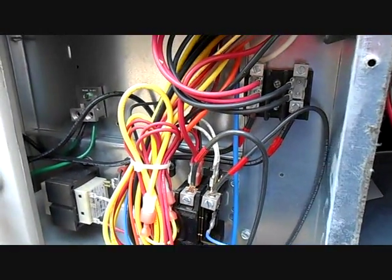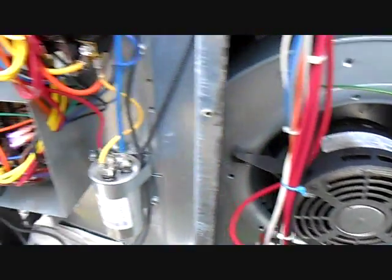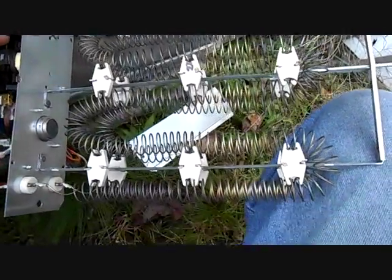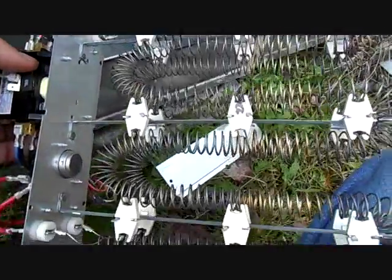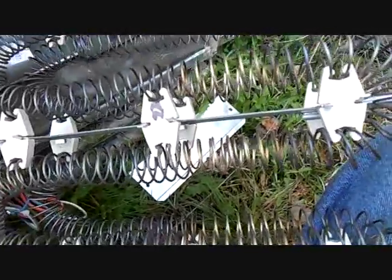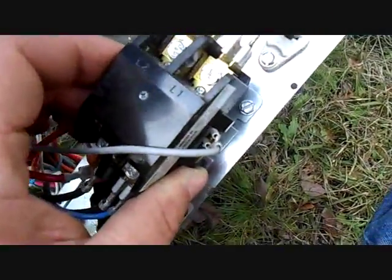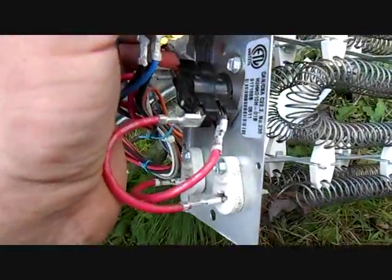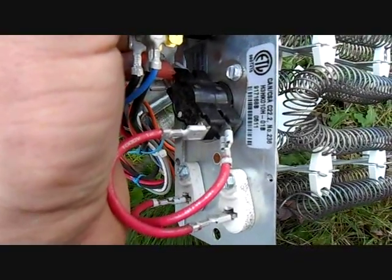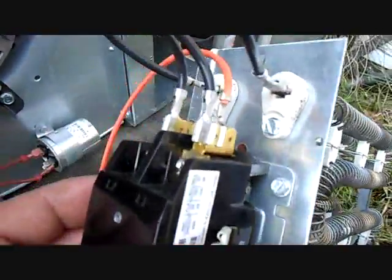Nothing out of the ordinary yet. I've used a mega ohm meter on both circuits and they're fine. I'm going to take a quick peek at the heater down here to make sure it's okay, but as far as I can tell everything looks pretty good — maybe just the breaker is bad. Here are the heater elements; I took it out and everything looks fine. Nothing separated. There's a little bit of discoloration, but nothing that's a real big deal. There's the heater contactor and a stack limit switch for the heater. Everything looks pretty good; I don't see any problems here.